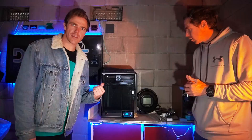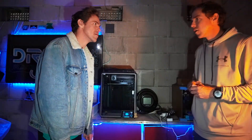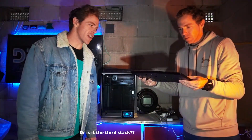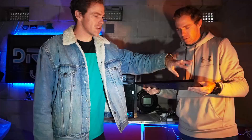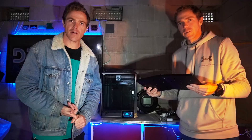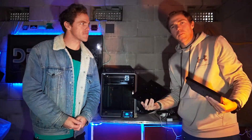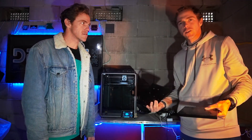Alright, so we've got the K1 working along here — it's been working all night and we've been keeping an eye on it. We're building with hyper PETG. You can see it in there and it's in the dryer. We are building these pieces. So we're making the second stack as designed on the CAD design. We cut it up and spliced them to fit on this bad boy. All the bolts will be in each section, so it works out quite well. This is to hold the flight controller and the power distribution — it's not under any structural load, but just in case we've made it at 60% infill, so it should be more than enough and capable of taking compression. Two parts are printed out, the third one is at 96%, and we've got one more piece to go to make a square, and then we can start doing the assembly.